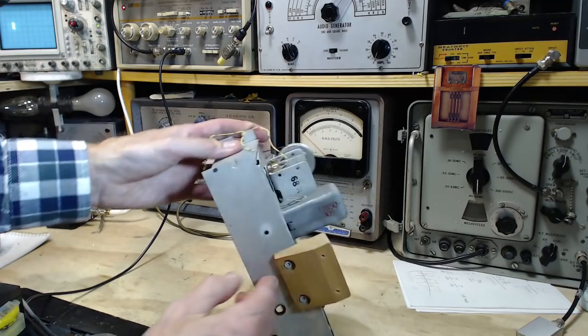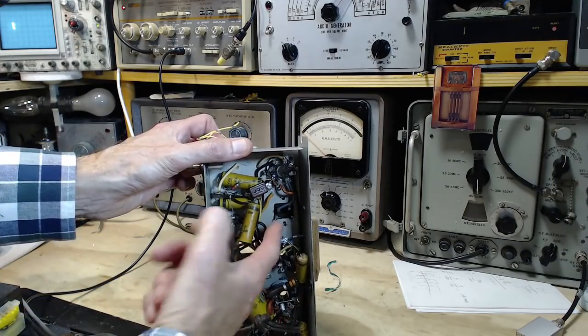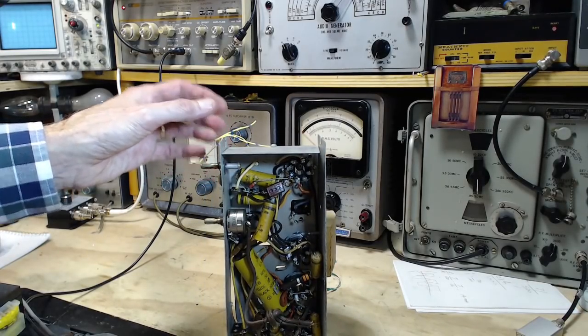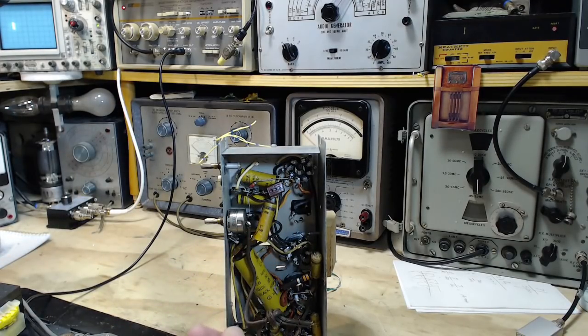The way I did it was I figured out this is the 12SA7 tube, the front end tube, so the signal's going this way, and I could figure out primary and secondary. If you hook it up backwards, fool around, you'll probably sort it out eventually. And the particular behavior of this coil, in that when I'm tuning the secondary it just changed the level, and tuning the primary moved the resonant point, I'm not sure if that's true all the time in all IFs. I just don't know. I've never done this before.